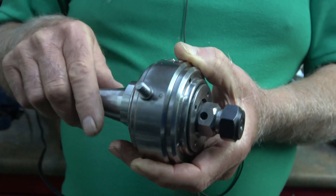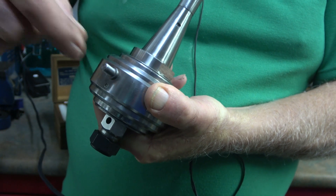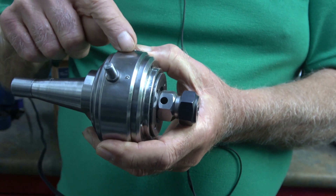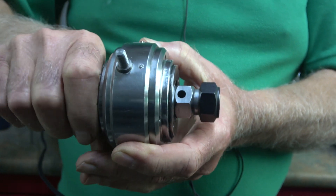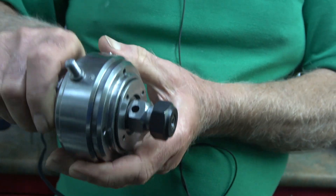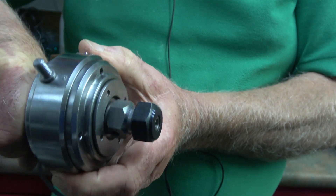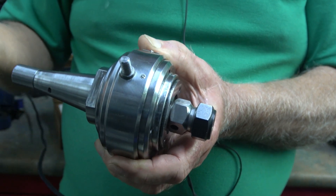The idea is you put this into your spindle. There's a little screw on the side where you would normally attach extension handles so that it rests against the machine. What you actually have inside is a planetary ball system, and the idea is that one rotation of the spindle increases the cutter speed six times. I'm only moving this half a turn and you can see the output end whistling by.